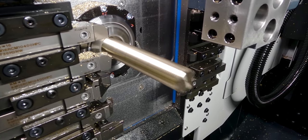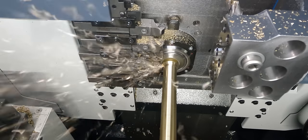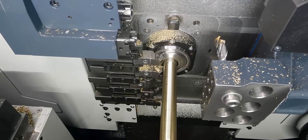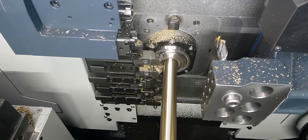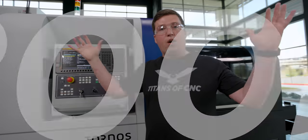This is why macros make it a lot easier, because if you program this with just regular numbers and realize after you did all that work that your segments were too long or too short, now you have to go back and start completely over. Where with macros, I can just change one single number and boom, my whole program is different.